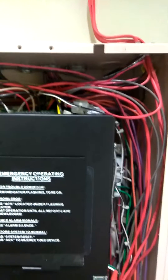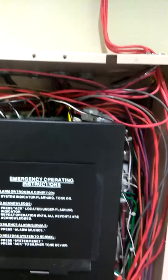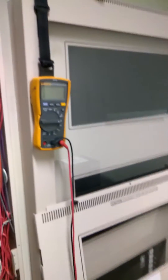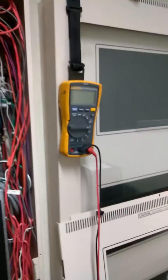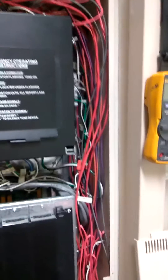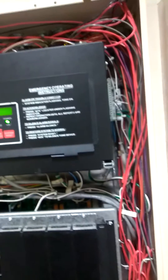For supervisory, it comes with these little dongles. There's a side that just has a red and black, and then the other side has a red and black, red and blue. Red and blue is wire nutted together. The red and black is on the normally open and common — that's for supervisory. And then the red and black on the side by itself go to terminals eight and nine. Red goes to nine, black goes to eight, and that'd be your ground.